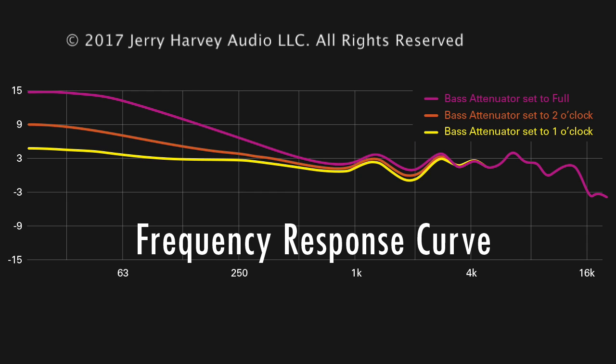We've got the dual lows doing a tight sub-bass bottom end, which is also a bandpass, doing from 20 to 200Hz. And we're high-passing the mid — for the first time ever, I'm actually high-passing it. So if you turn the bass off, you have nothing below 200Hz. There's a nice crossover from the low to the mid at 200Hz, and then it goes out to 3kHz, and then from 3kHz out to 20kHz.